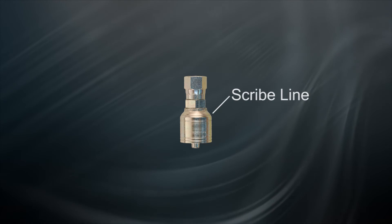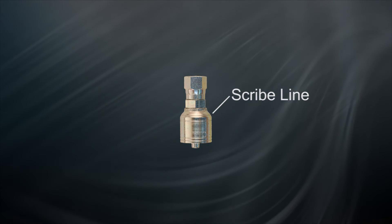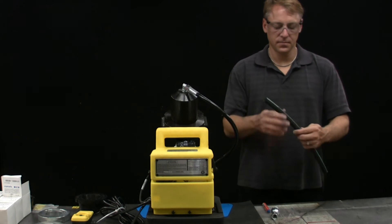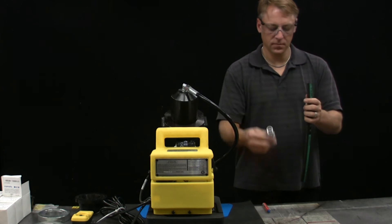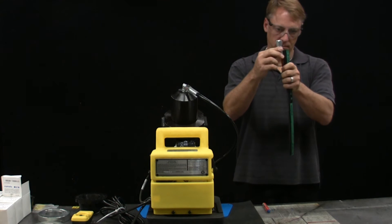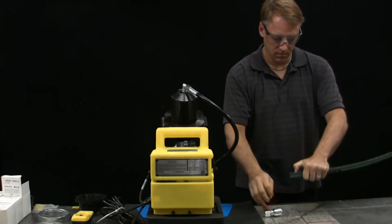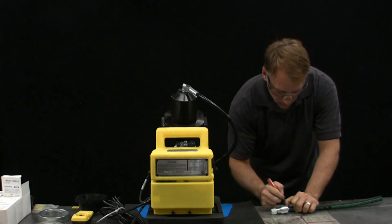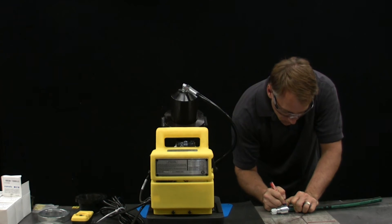Keep in mind that it is standard practice to mark the hose where the fitting is supposed to bottom out. All MatchMate Plus fittings have a scribe line, which is the nearest ring on the fitting towards the port or threaded connection side of your fitting. Line up the hose end to the scribe line — this shows you where the bottom of the collar should terminate when inserted properly onto the hose. Mark this spot with a rubber marking crayon and insert the fitting into the hose.